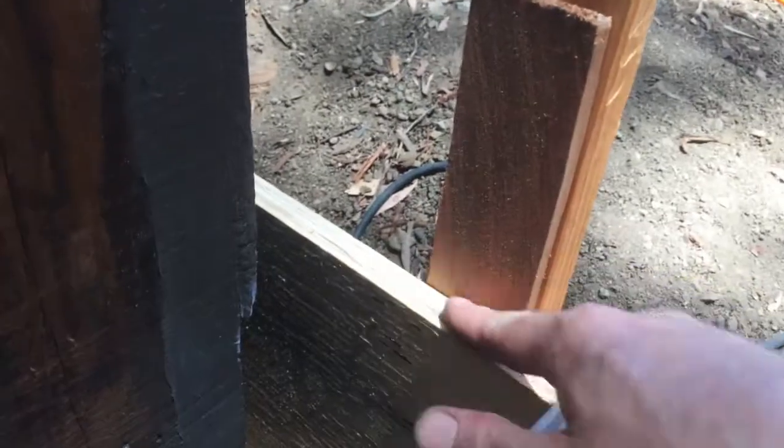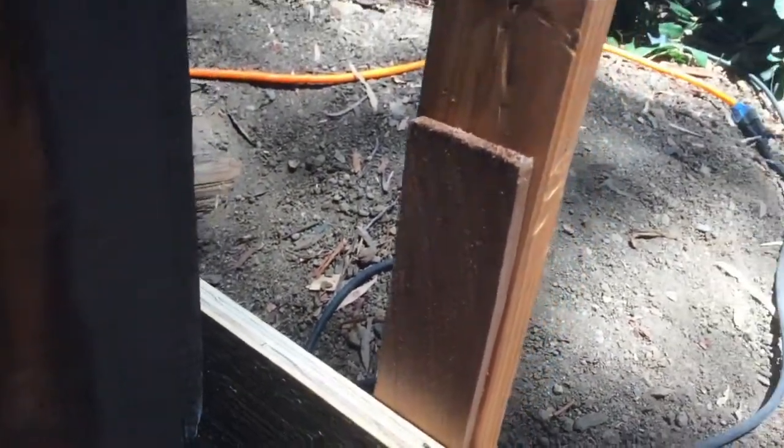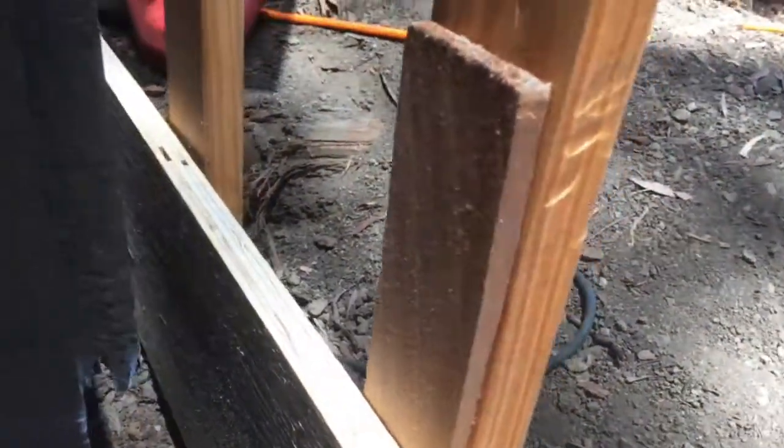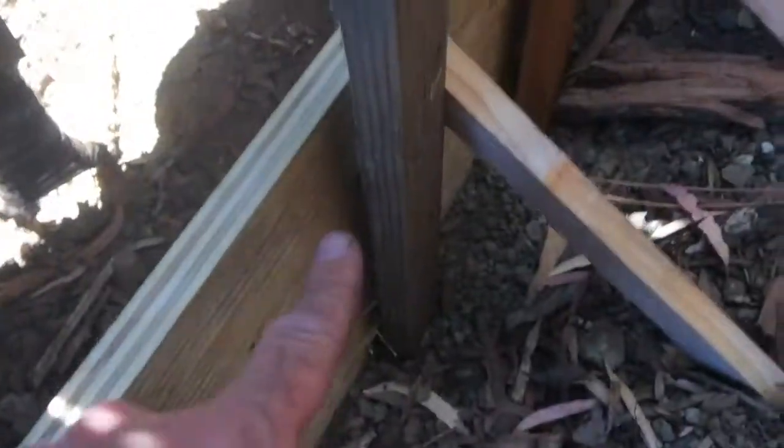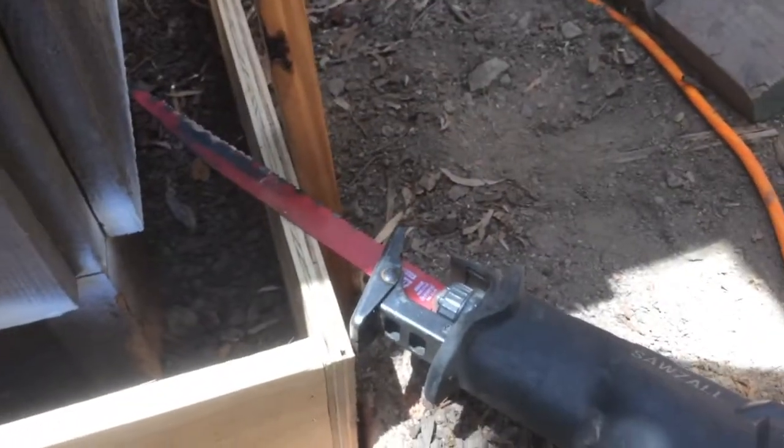we cut these off level. See that sticking up? We cut this off level here so that when we're taking our trowel, we don't have to hit that. We could just use this, because the top of this form is our guide. One other thing I did back here, I put in a couple of triangles, see? And then when all that concrete's pushing on here, these little supports are gonna help, and they're nailed in. I nailed these with the finish nailer to these.